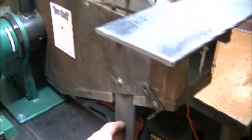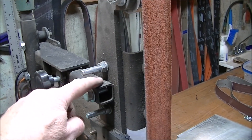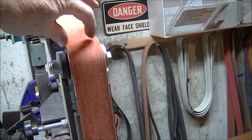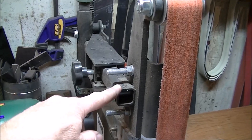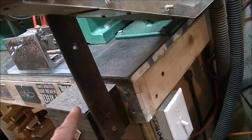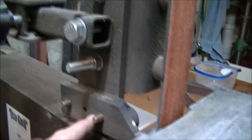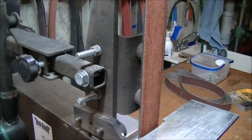I put a metal bar right here and it hooks to my bench. Their little arm out here is only about an inch or inch and a quarter round square tubular steel, so when you put pressure on it, it would make the belt ride back and forth because it would just flex. So I put this piece of metal to my workbench — it goes behind this piece of wood here and hooks to this bar right here with just one bolt, and it makes it really solid. So that's one upgrade.